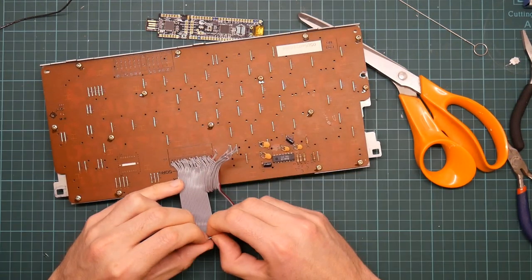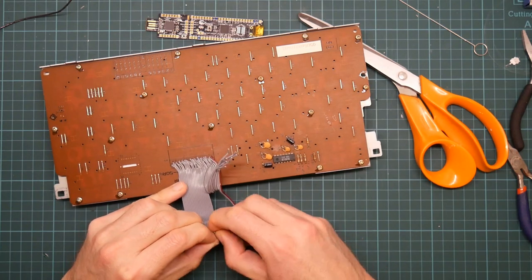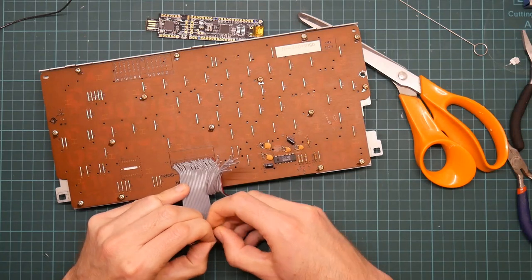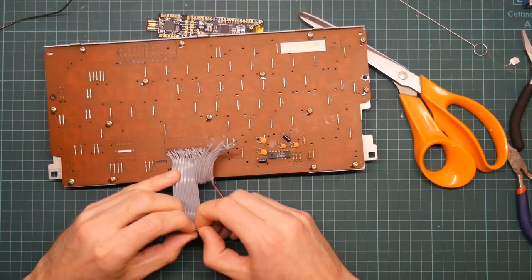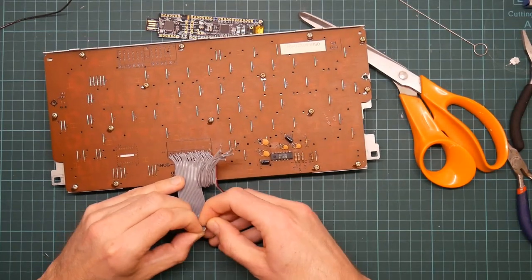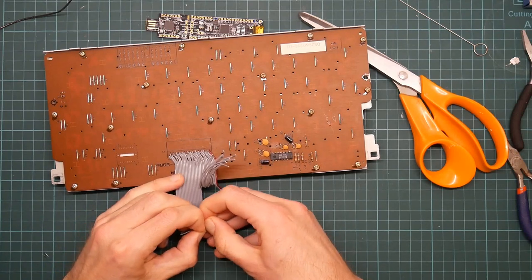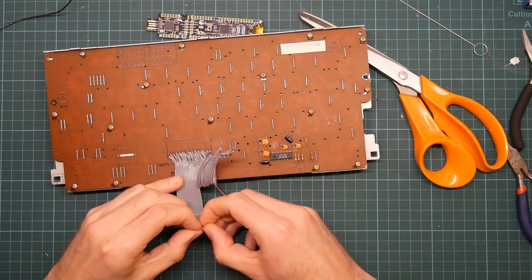Also, soldering the cables on, in the right order, is going to be interesting. The cables are going to go to the underside of the microcontroller board, so that we have access to the top for pushing the buttons. So we need to make sure to do the near side first, so that we don't end up covering the things we want to solder through.